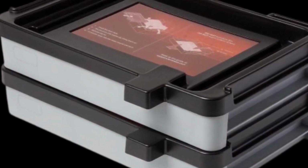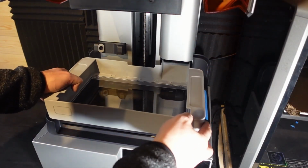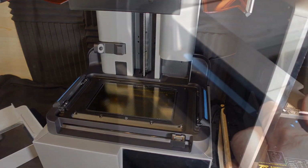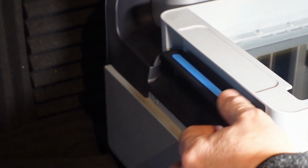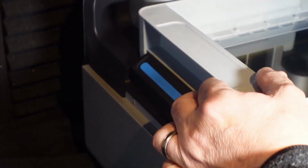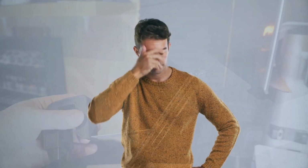Cleaning the vat is difficult and it lacks an easy pour spout. The Formlabs approach recommends using one vat per resin type, which can increase cost due to each vat costing £94.80. And the vats come with lids for easy stacking and connect to the printer via two quick release catches for one-handed operation. So just to reiterate, you cannot change the FEP or release layer, if you want to call it that, on these vats.